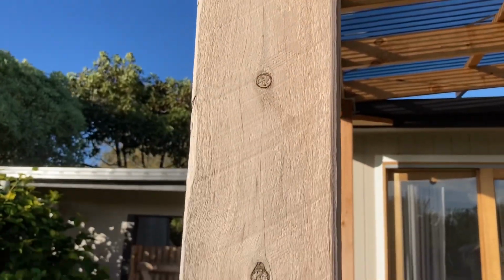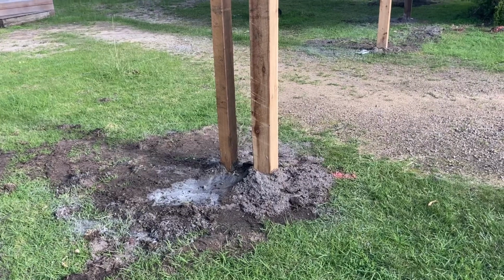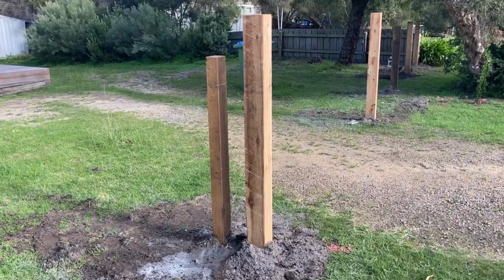The cypress that you get from hardware stores is basically used for either poles in gardens or building of gazebos or fence pickets. It's a very durable outdoor timber. Most softwoods are not very dense, but native cypress is perhaps a little bit more dense than most, with a specific gravity of somewhere around 0.55 to 0.6 of water.